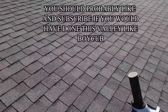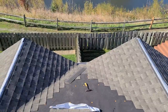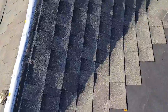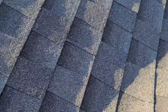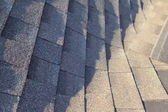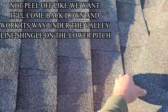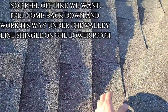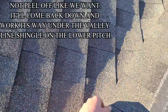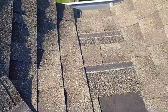We've got this big roof over here, and all this volume is coming down into this. So the main volume is coming off of here. You would want that water to usually peel off. But there's a pitch change here. What's going to happen is that water, it's going to come up here, roll down, and try to hit here. This is a 4/12, and this is a 6/12. So even when there's snow buildup, it's going to try and push its way under here, which is going to cause problems, especially in here.